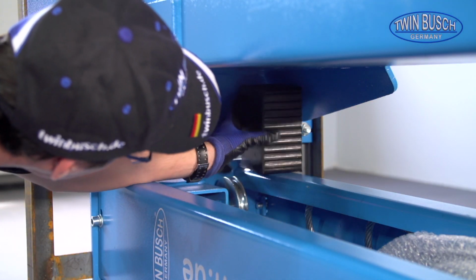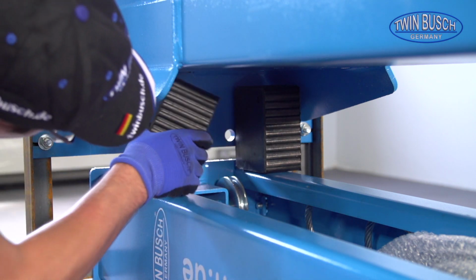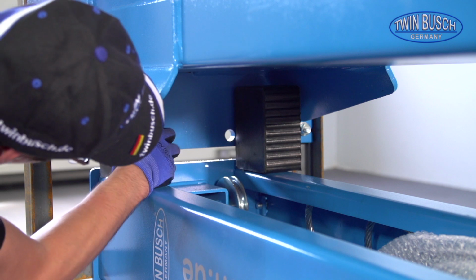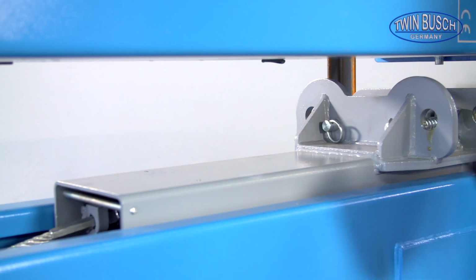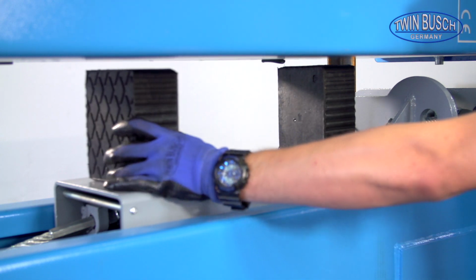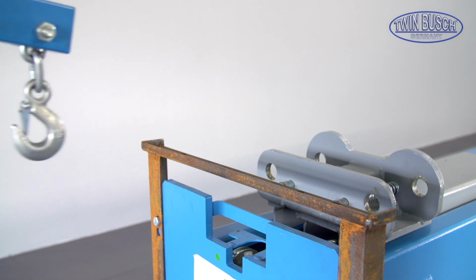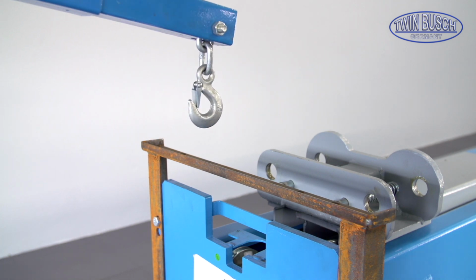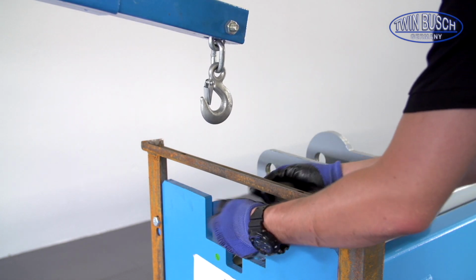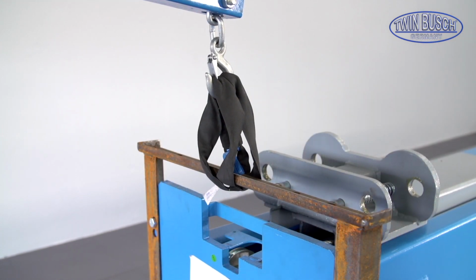Before removing the screws from the transport frame, we will secure the space between the posts as well as the space between the second post and the floor. This way we avoid scratching the posts against each other, while also relieving the screws to remove them. We lift the posts slightly so that the transport frame doesn't touch the floor again after securing the space between post and floor.